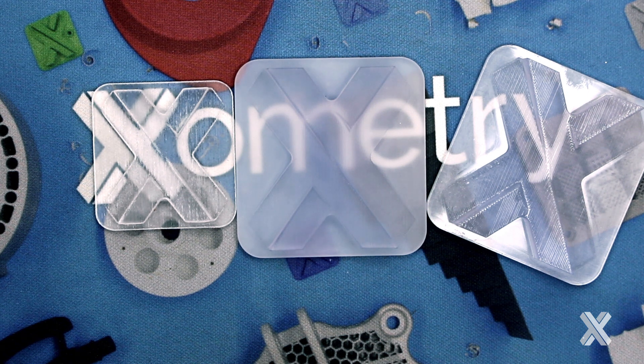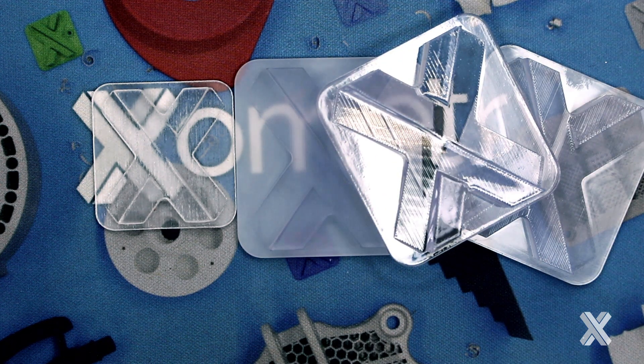I could do some tricks to these parts. For example, I can go and do some light sanding and then clear coat to get what we call a quick clear. That'll be a custom finish on Xometry or something you can do yourself. I like to use a UV protective clear coat for this, but you can do this with a rattle can and some careful work — just make sure not to over deposit and lose your feature definition. If you have any more questions about clear parts, especially 3D printing clear, feel free to reach out to me. We're always happy to help with our guides and our other videos. Thanks so much.